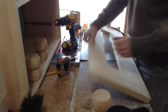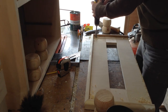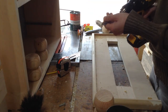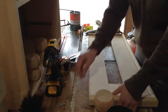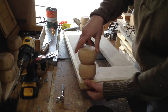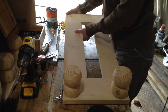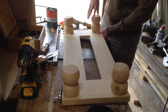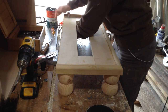I'm keeping the legs as far to the edges as possible because this dresser is so skinny it's already going to be a little top-heavy, so I wanted the legs as wide apart as possible on the bottom. I pre-drilled holes for bolting and countersunk with a spade bit so the bolt heads don't stick up into the cabinet. I checked that the bolt head clearance is below the plywood, then simply screwed the legs in place. The base is nice and flat — I can attach both the molding and the legs, and it remains perfectly flat for attaching the cabinet.